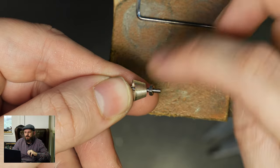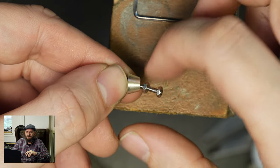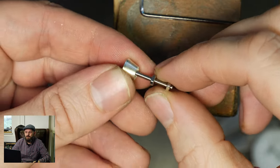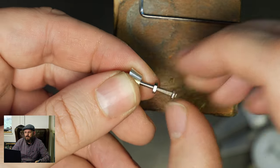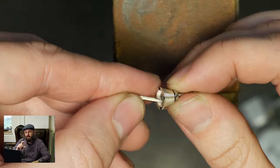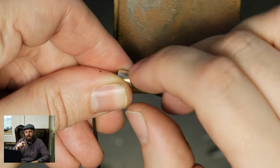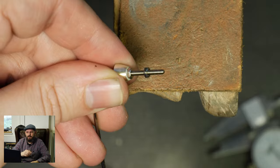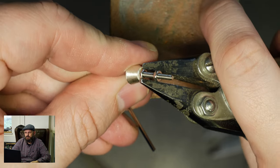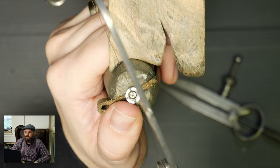You can buy these little nut-and-bolt sets off Amazon or eBay — I think this one's about 1.5mm diameter on the thread. They come in quite useful and you get a multi-pack. By the time I've got the V shapes out of them, and by the time I've started filing, you'll see I've actually started filing into the head of that as well. So you generally have to use a fresh one each time, unless you're lucky enough that it fits right down in the collet — but that probably happens one time in a hundred.